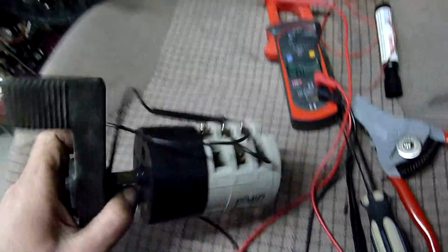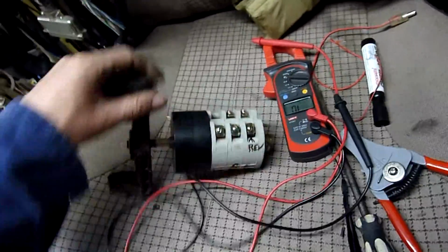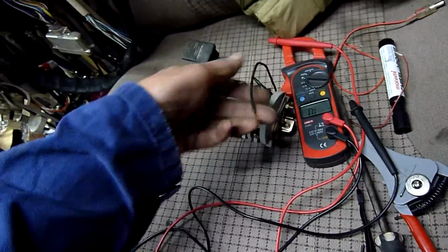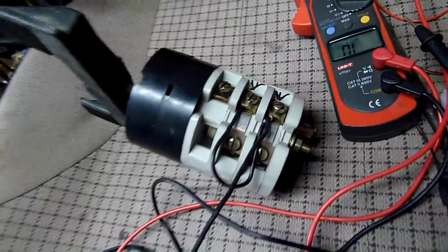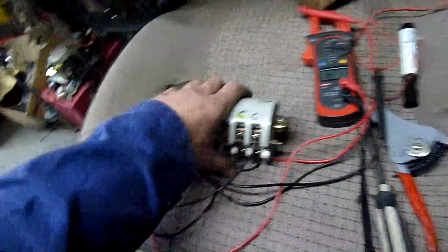There are plenty of spare contacts for other things. It's a hell of a drum switch. It's a 40 amp drum switch, but that's exactly what I want. Nice sturdy piece of equipment. So yeah, forward and reverse on there, and the 2 commons. I'll just bridge that out properly. The wire's barely in there. I need some fairly big spade terminals. But once it's all done, this thing will be bulletproof.